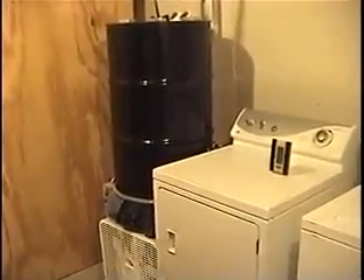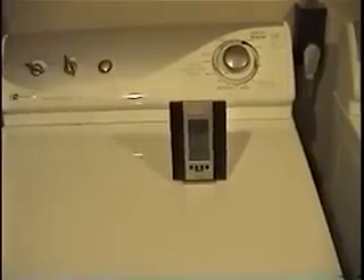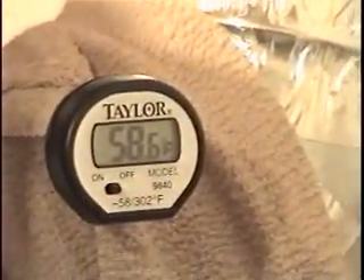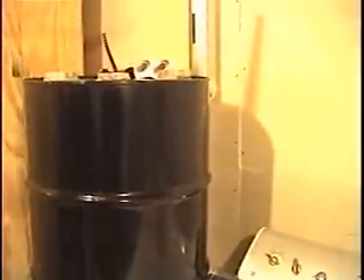We should have about another 15 minutes and then have a load ready to go. Okay, we're ready to start drying. Taking some quick baseline readings: room temperature 63.4°F, top of drum 64.5°F, air outlet temperature 64.4°F, drum outlet temperature 58.6°F, and inlet temperature 62.4 degrees.